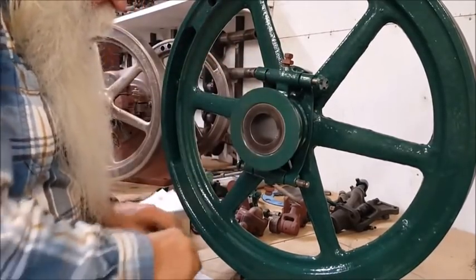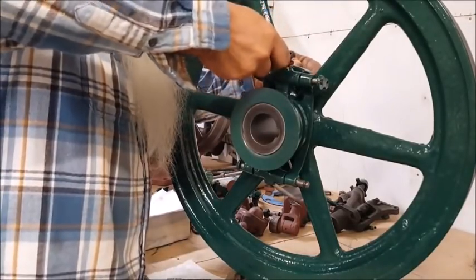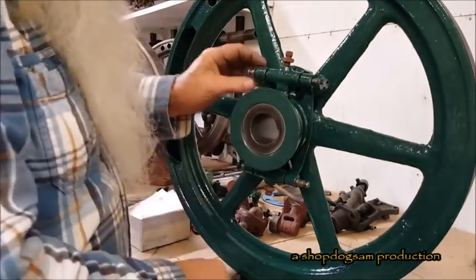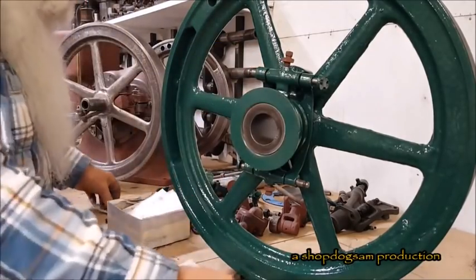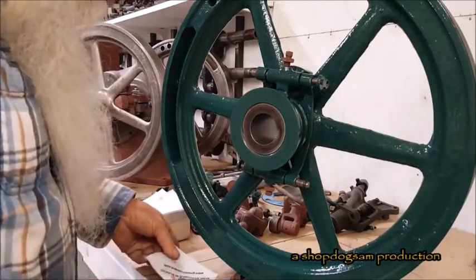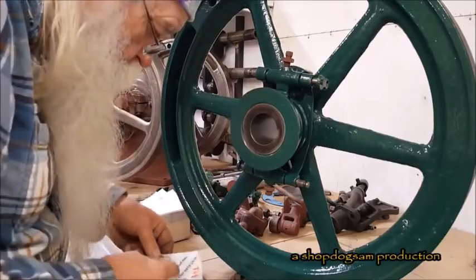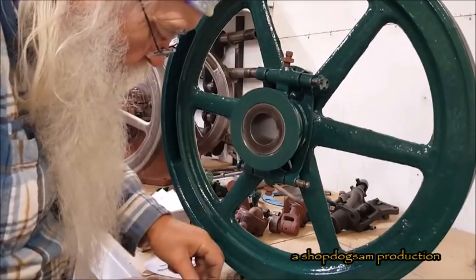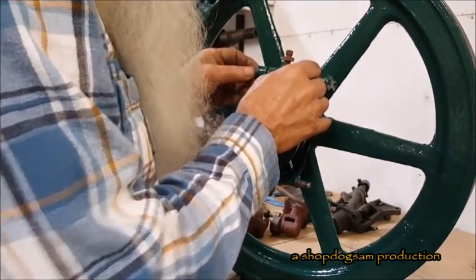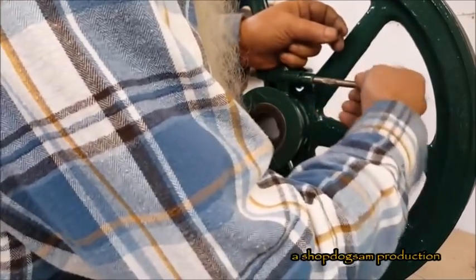So you figure up how many you need in there and what amount. I'll show you. And you tune that up. So you loosen that up. Okay, just looking at it, I'll show you. This is that thickness. This is 62, and this is 47. So you can actually see the difference. But I think this 47 will be too much for that end. So what I'm going to do is pull that back and come all the way down. I'm going to put a 62 thousandths in there.